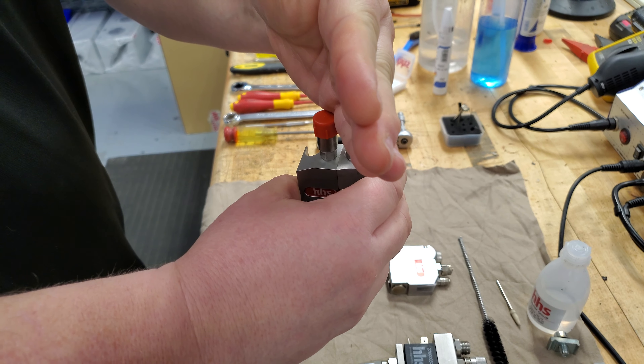The next thing we're going to go over is the DDL 500. It's the same principle across all the guns. On this one, it has a set screw that you have to loosen. You'll notice that it has a dot and a dot — that's closed. And then the dots on the side show your operation range. Right now we're closed, but I loosened the set screw. So basically what that means is we can hold the set screw and adjust down the stroke.